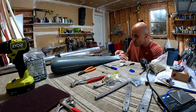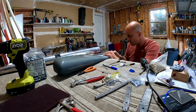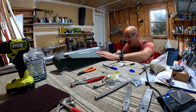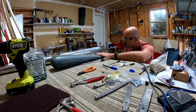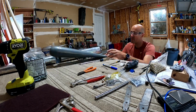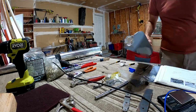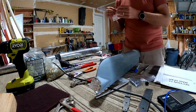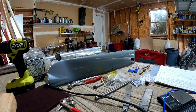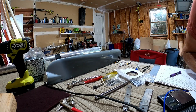wing leading edge lights. I built them months prior to even receiving my empennage because I was just kind of waiting and looking for something to do. But anyway, the tail position light, I keep wanting to call it a beacon, has a special mounting thing. It's a little bit different from the Vans one, but as you can see there, I did get it in, and it fits really nicely after I did that smoothing of the part before.